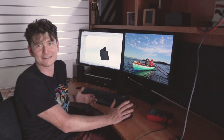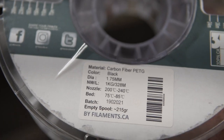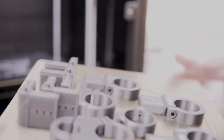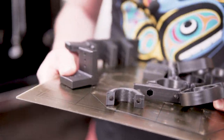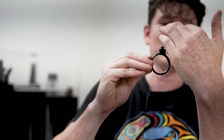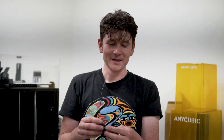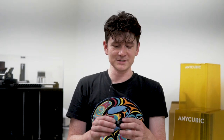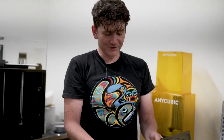That standoff not only gives the frame to support the panel, it also provides a location to screw down and hold it in place, making it easy to remove the solar panels if needed. The plastic material these are printed with is PETG with carbon fiber reinforcement. PETG is a nice plastic because it's UV resistant and super tough — it's not brittle. You can just feel this resin; it has a beautiful finish, and the carbon fiber gives it a lot of rigidity that should hold up fine in marine exposure.